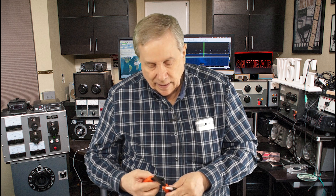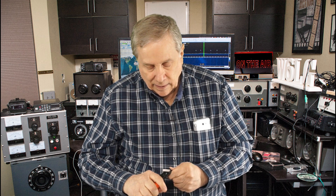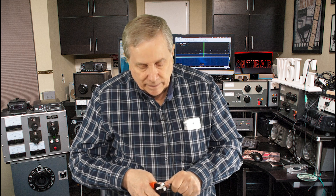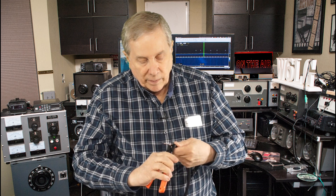I've pulled that off and I'm going to take off the dielectric. The next thing I have to do is remove a little bit of the jacket on the coax. I've got the center conductor long on purpose and I'm now going to pull off a little bit that didn't quite cut through, so I'm going to do it manually here.